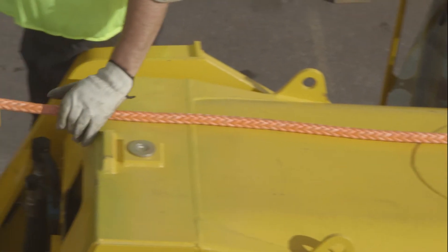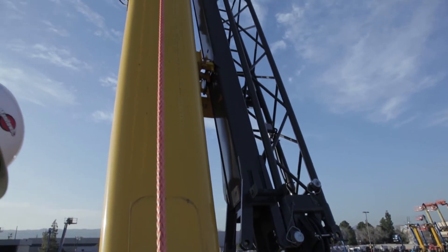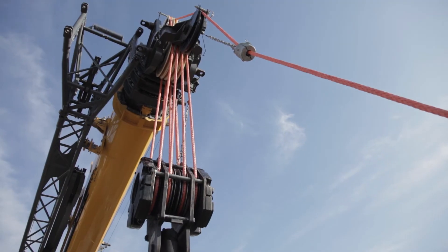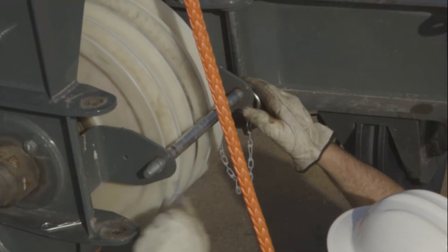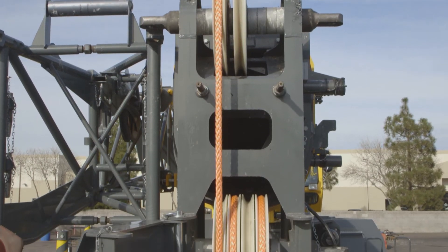You also want to look up and down the length of the boom. Any areas where in extreme pick angles you could contact sharp corners like the wear pads and the gin pins out at the end. You want to make sure that there are no nicks there from any wire that was used previously or any sharp machine corners.